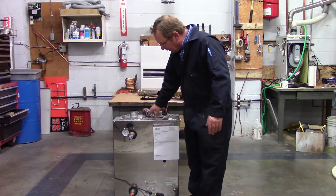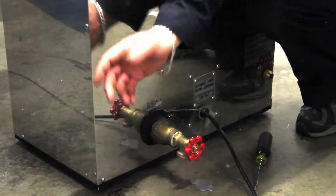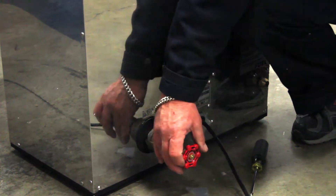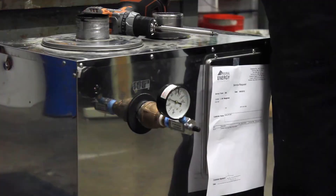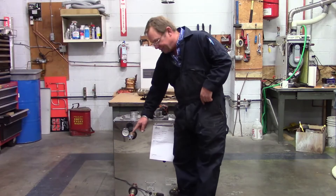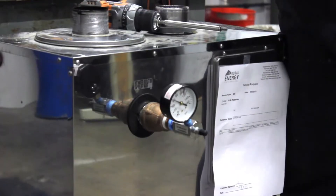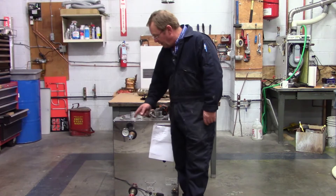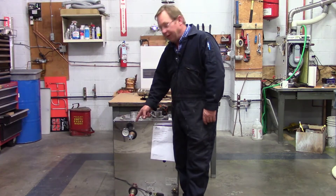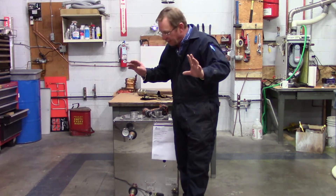When I am doing the pressure testing, I always use a boiler drain down here at this section, and the reason is this makes it very easy to just throw my air out of here. We definitely do not want to take this device off with any pressure inside this piece of equipment. Right now I've got about 60 pounds of pressure in there. If I spun that fitting off, it would shoot that fitting all the way across the wall at a high rate of speed, and that's how people get hurt.